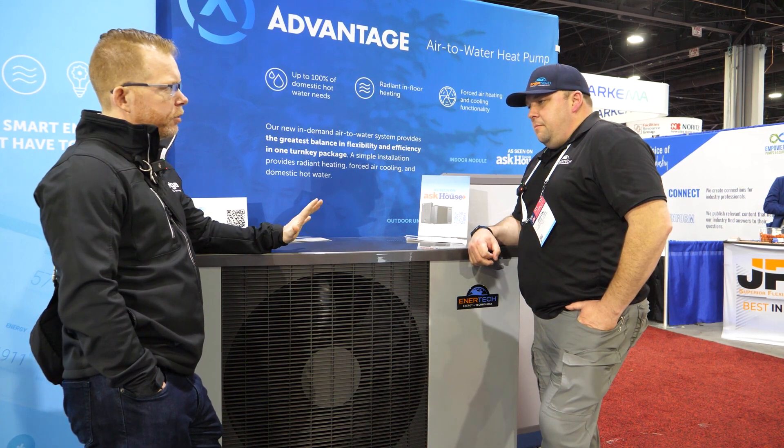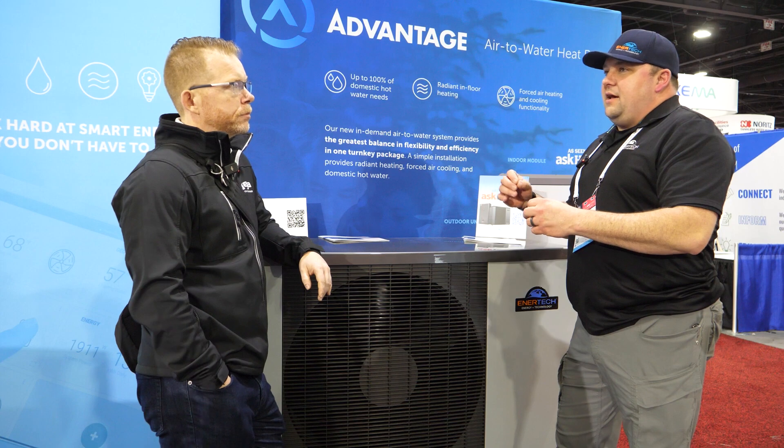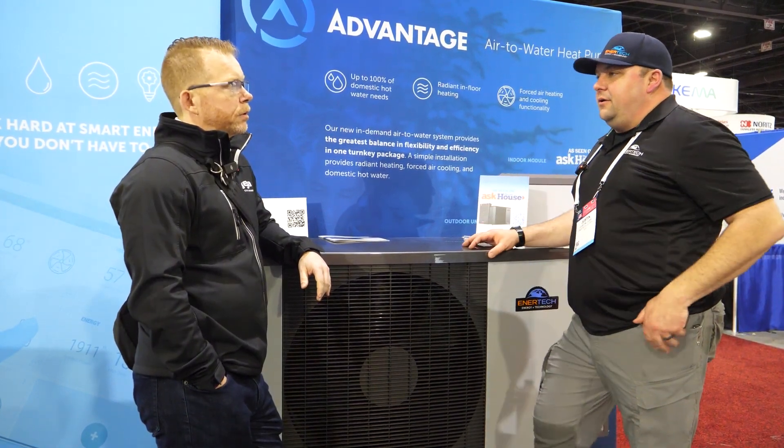These units are a little bit different because you guys are not just supplying an outdoor unit. You guys are doing something unique in that you have a fully engineered indoor unit that's designed to be mounted on the wall and take the headaches from the contractor of how do I design an air-to-water system? As a guy who's working on the training for air-to-water systems, there isn't a lot of training. With our indoor module, we work out everything from the changeover time and when we direct water to the domestic hot water heater or to the space load heating or cooling.